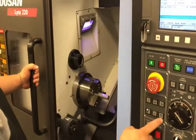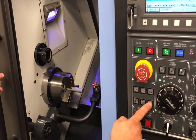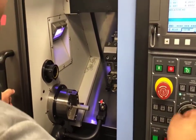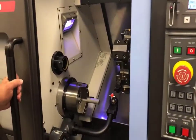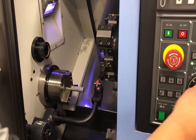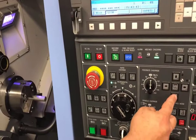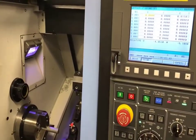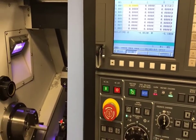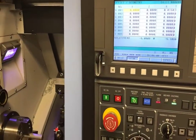We'll open up our door and go into handle mode. Whenever I push the handle to go in X or Z, I push the handle again. I'll go into Z mode first and handle towards my tool. As I get closer to the tool eye I'll reduce my increments to a lower feed. Once I'm within a hundred thousandths of my tool eye, I'll hold the X negative jog. I need to be in jog mode, so I'll switch to jog and then start moving down.